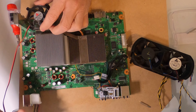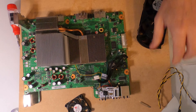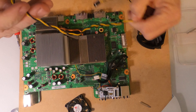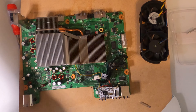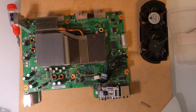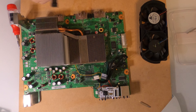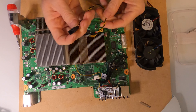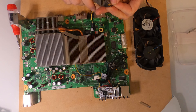I'll run this around and connect it to the fan. I'm going to cut the wire off this connector. I want to use this extension cable to give me just a little bit more. I'll cut this in half, solder this end onto here, and then solder the other end onto this wire, and use some heat shrink tubing on top of that to give some protection. Let's go ahead and cut this wire in half. I'll take this end — it actually does match here, so it's kind of like an extension. Just strip that back a little bit.